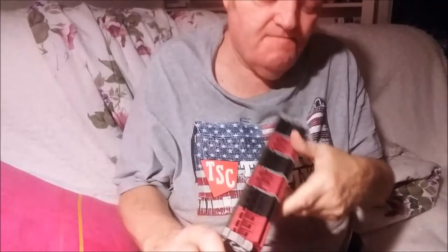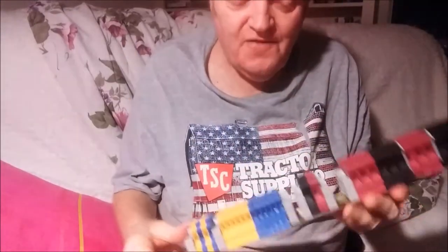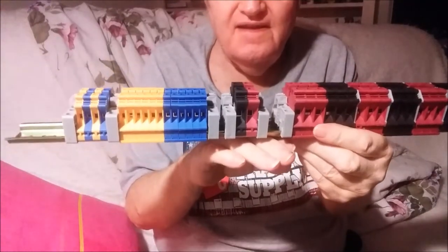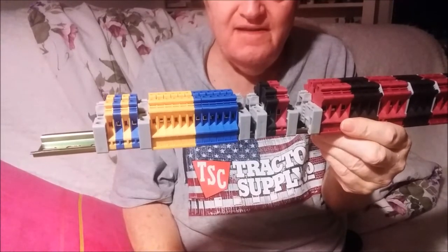This rail here is 35mm — there's a wider size, might be 40mm. I haven't got a loose block to show you; they're all snapped on. These blocks I got from Clarice fit both sizes of DIN rail, so you can use the wider one or the pretty much standard 35mm. Ours are sitting up with an inch and 5/8 space underneath of them. I bought plastic standoffs rated at 1600 volts and 1200 pounds of pull.